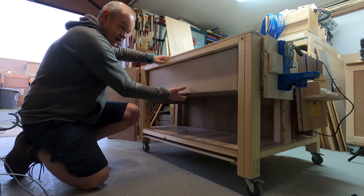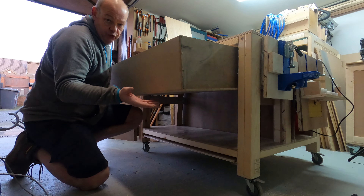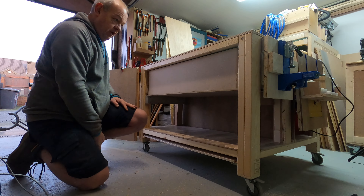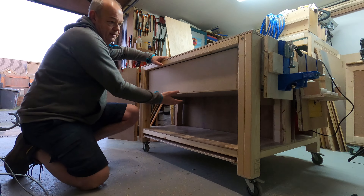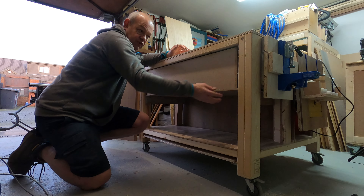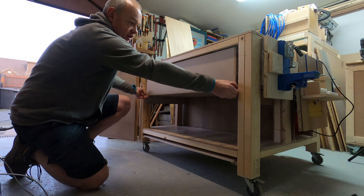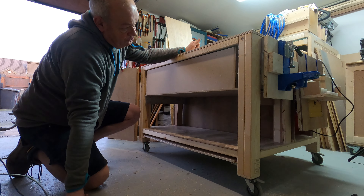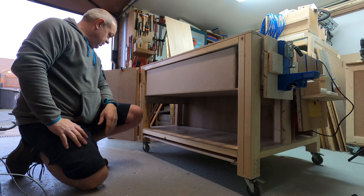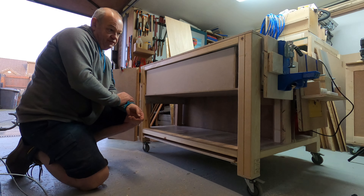It's still a really, really nice fit. With both sets of runners in, the drawer's not falling forward until it gets to a certain point — but obviously I'd want it to fall a bit forward so I have access to it. The last thing I need to do is put a drawer front on. I've deliberately lined up the two parts of the slide so that when the drawer face goes back, that's as far as it will go — it stops the drawer going all the way into the recess. I'm going to use a piece of very thin MDF as the drawer front to start with.